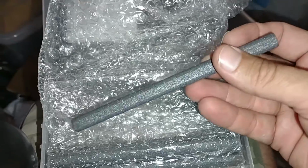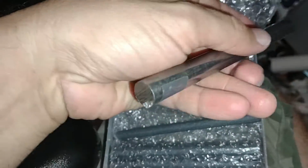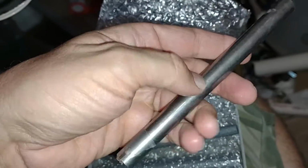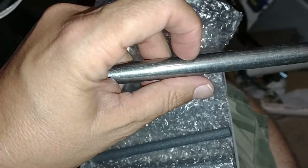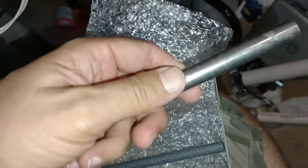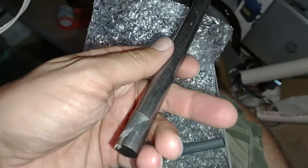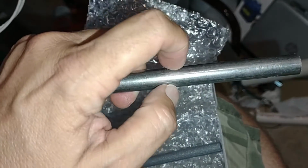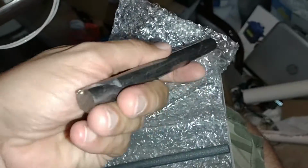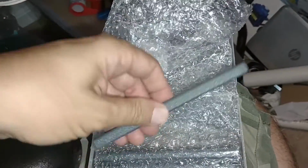I tried some other cores initially. Let's take a look here. Okay, these things are super magnetic. So this is just a metal iron core, and this one didn't work very well. And these are lossy. They produce eddy currents because they're actually metallic. When you pulse a transformer around them, the current will flow, and you don't want current to flow in these things, because that will cancel out your magnetic field. Current flows in a way to cancel out the magnetic field. Ferromagnetic materials enhance the magnetic field, but this one is too conductive.